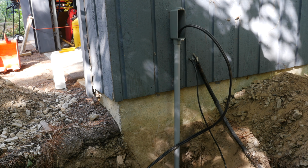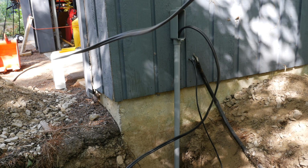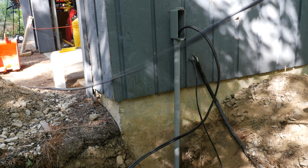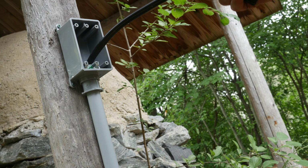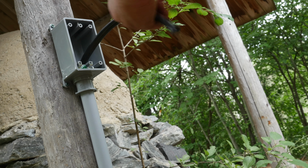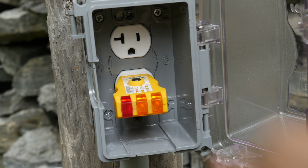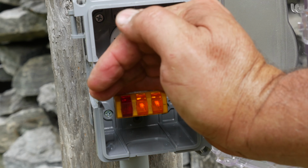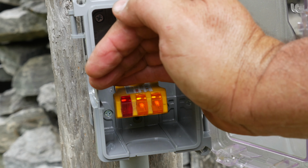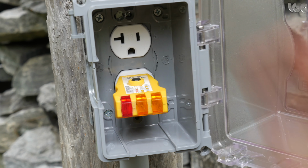With the majority of the conduit glued, it was time to install the riser that took the cable into the garage and to the breaker panel. Then it was time to prepare the box for the socket at the other end and get the wire ready for connection. With everything closed up, it was time to use a tester to make sure that all the connections were the right way. This one also has a little button that you press to test the GFCI, and it worked fine.